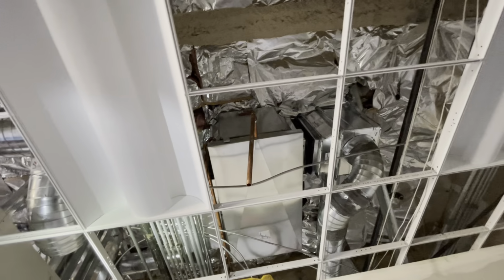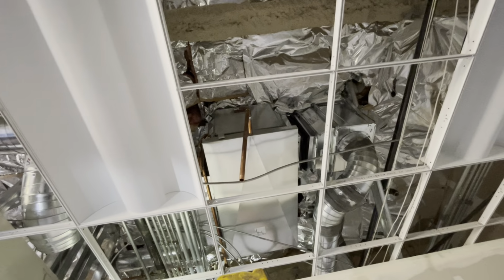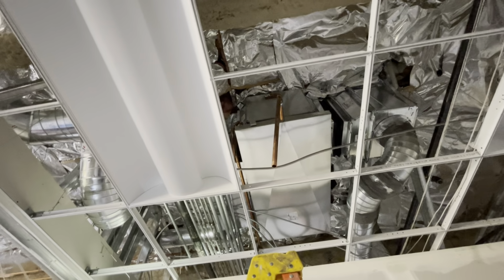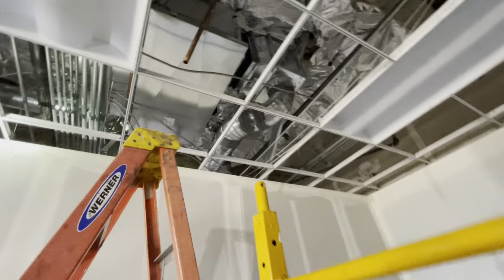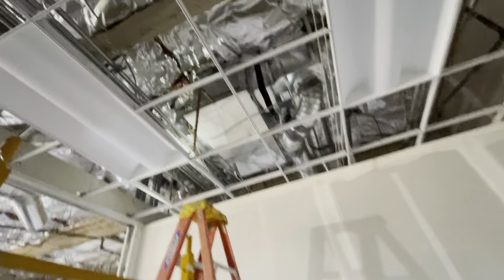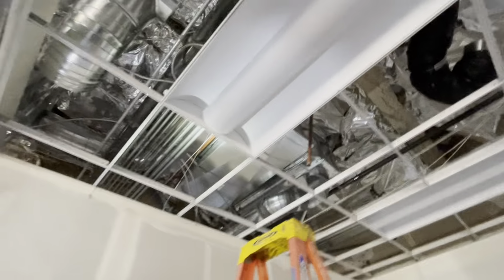So it looks like we need to reroute that condensate. Yeah, to give a little bit of room, because that's the one I was trying to do myself. If you could just 90 it down and move it out, then you just slide the filter right out. And then the access for a potential compressor replacement is back this side here. That's right. Yeah, that's perfect. Okay, cool.